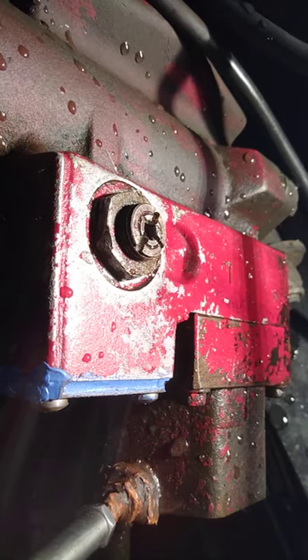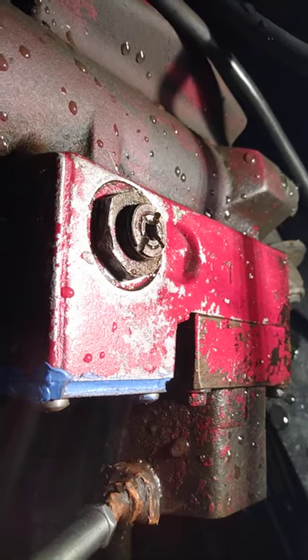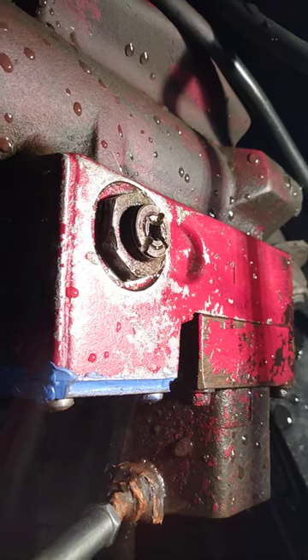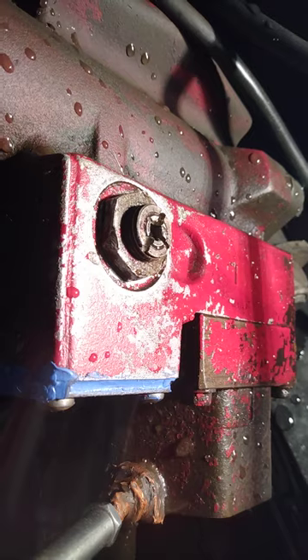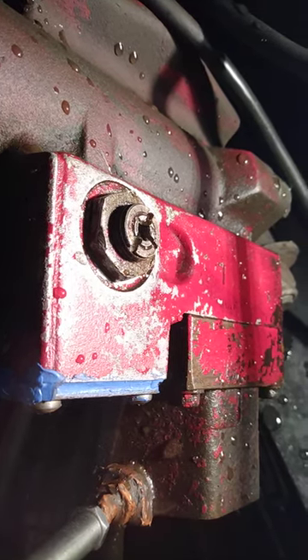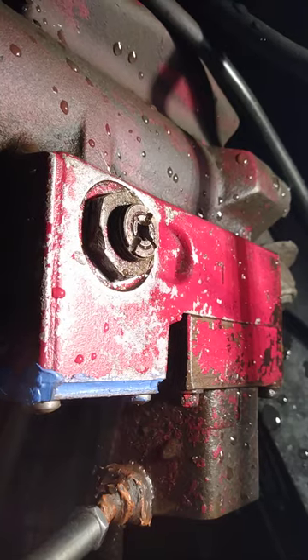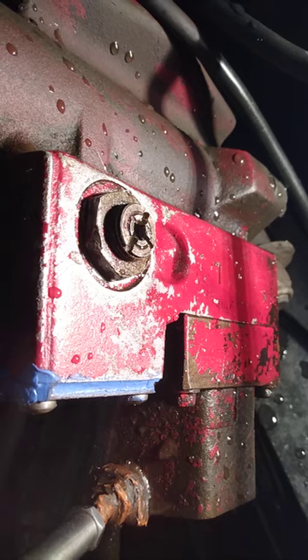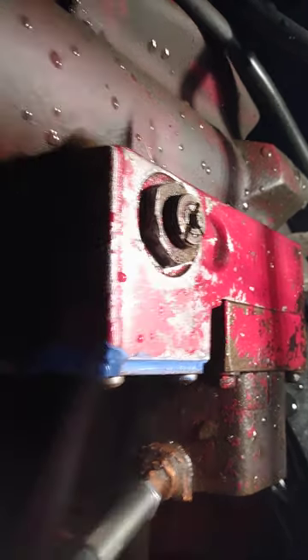It's the only complaint I've had on this plow in 24 years — just a disaster to deal with. Check the depth, take a pic, do everything you can to make sure when you put it back in it's in the exact same position. The new cables' crimp style was just different from what came out — that's what caused my grief, it wasn't perfectly centered. Adjust it a little and everything works great. Just got to deal with that o-ring now. Everybody be safe.